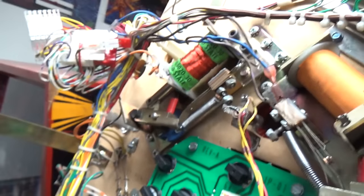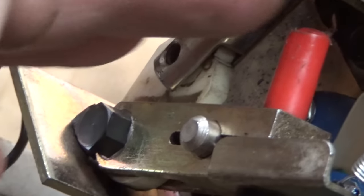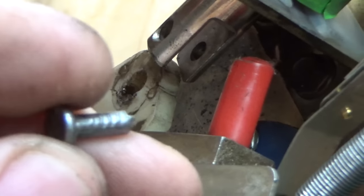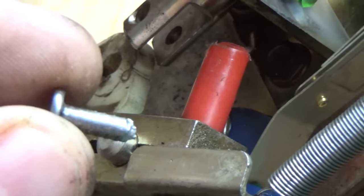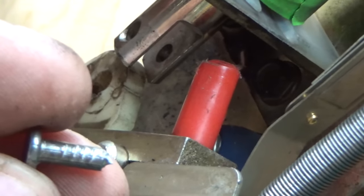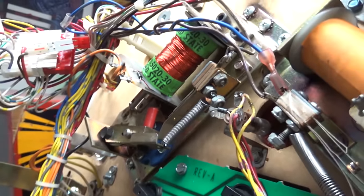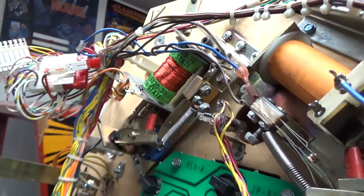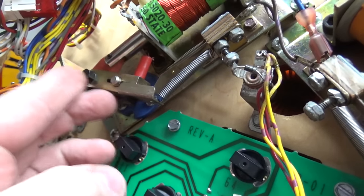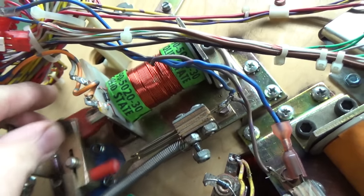I got the spring back on it. If you mess with this other flipper, the roll pin is missing and they had a nail in it. So we need a new roll pin or a new plunger for that one. I put a new plunger in it and everything's cool now — it opens the switch as it should.